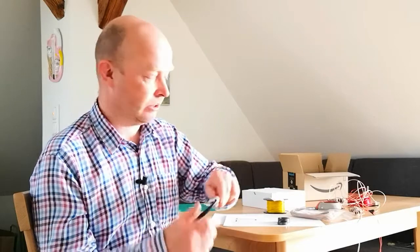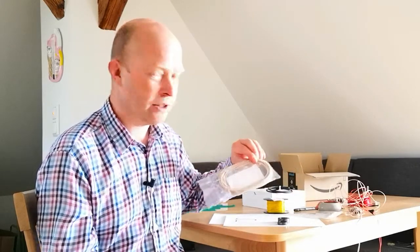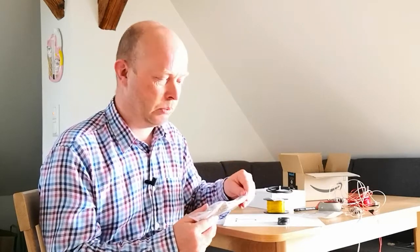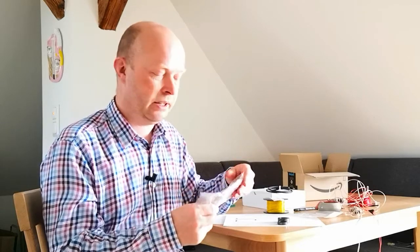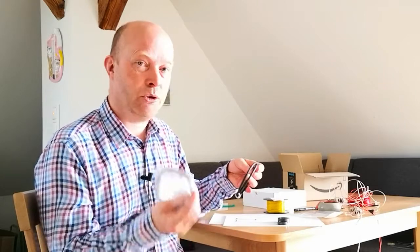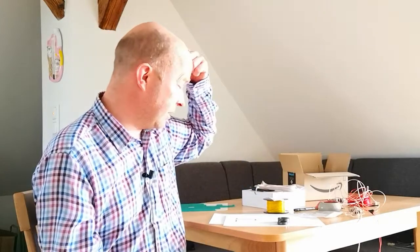And then some adhesive lined heat shrink tubing for the feed points. You'll find the inner conductor on RG178 is extremely thin and fragile. I've had it actually snap on me on one occasion. If you're stretching the antenna between 2 points, you don't have any support in the middle, you're going to easily break the feed point there. So you've got to have some adhesive lined heat shrink to take the strain off the inner conductor. It's just not thick enough really for rugged use. That is about everything you'll need.